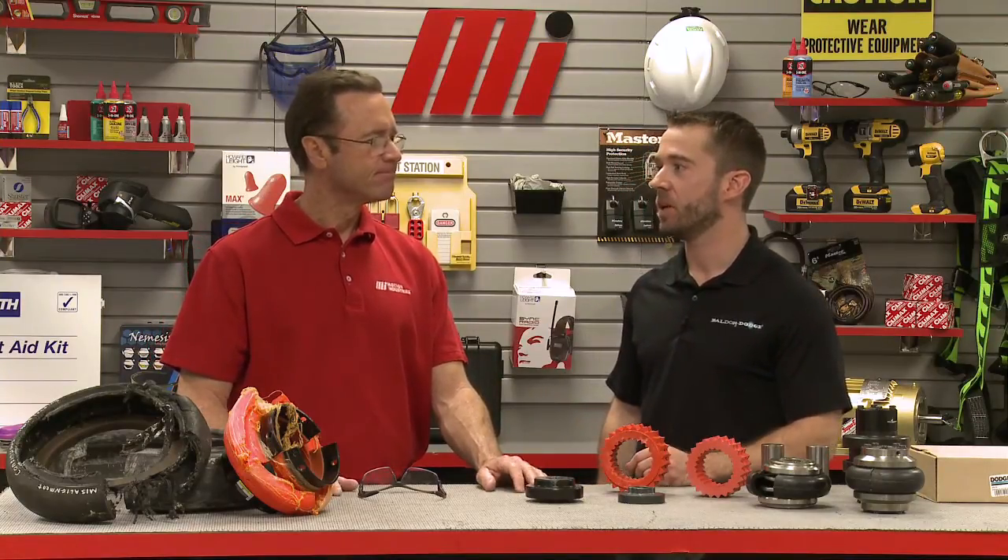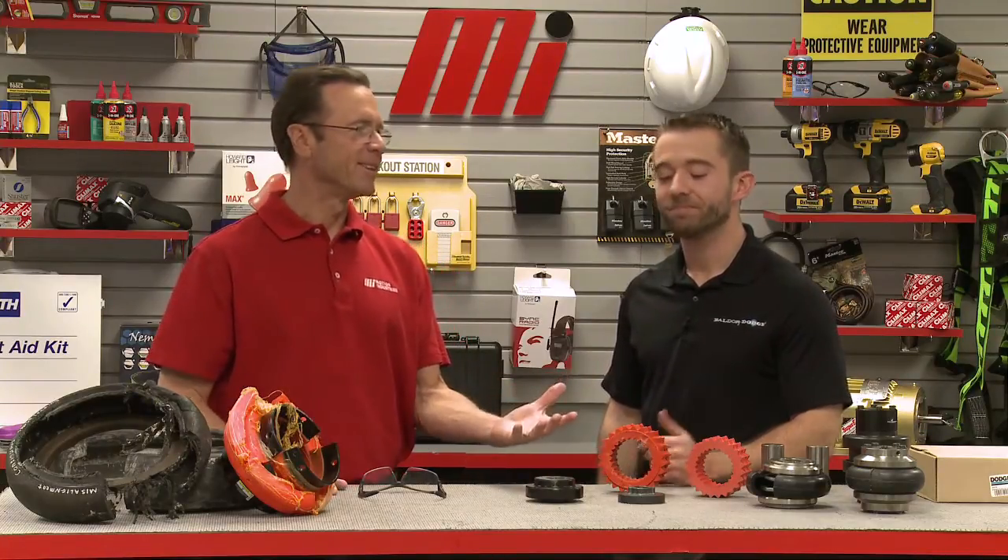What we've got in front of us are a few different examples of the two most commonly used elastomeric couplings: both tire and sleeve style couplings. Elastomeric couplings are an economical, maintenance-free solution capable of accommodating high amounts of vibration and misalignment. Let's start by taking a look at examples of the three most common failures, then talk about the best practices to avoid failures and keep equipment running successfully.